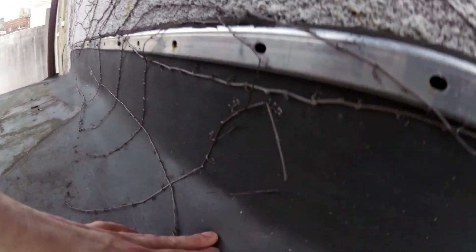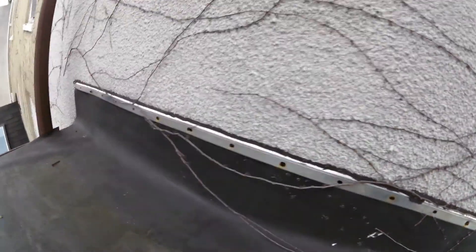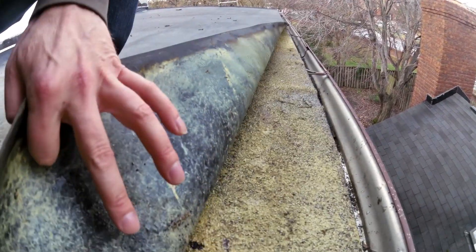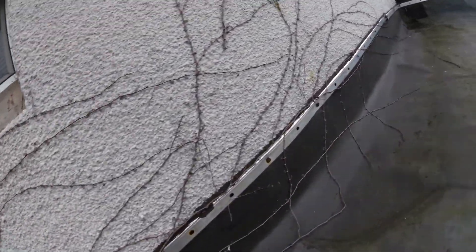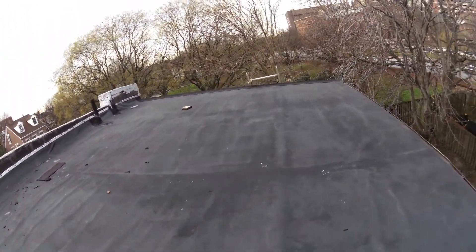Possibly that one leaks right here — you've got an air gap here. This membrane is glued, and there's the glue after it dries, it's supposed to be sticking to this. Actually, you're not supposed to glue it to this type of membrane, so it's loose here. I think this membrane is glued to the wrong substrate.